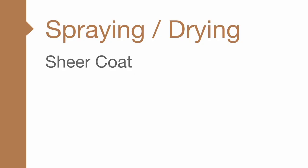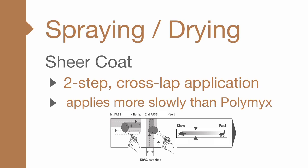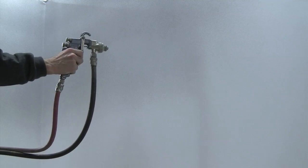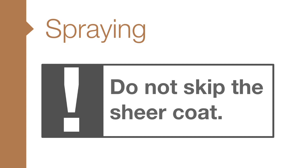The Zolotone light reflective finishes are applied in a two-step cross-lap application. Be aware, these finishes require a slower application speed than Polymyx, our acrylic multicolor finish. The first step is the sheer coat. Begin by working at a section as wide as you can comfortably spray, and work west to east or east to west depending on the wall. Stance of the gun tip is 12 to 16 inches from the wall. Work with a 50% overlap with each pass. Feather the edges slightly to prevent banding. Compare the color to the control sample. Do not skip the sheer coat — this step lays a color foundation and gives the finish its durability, washability, and repairability.